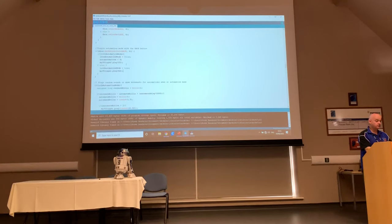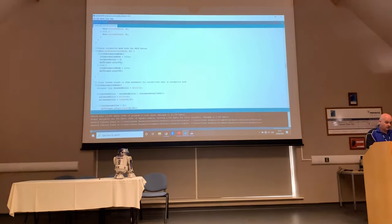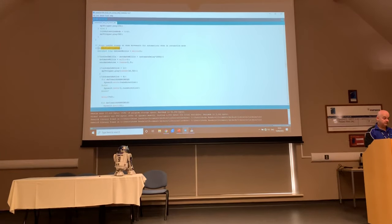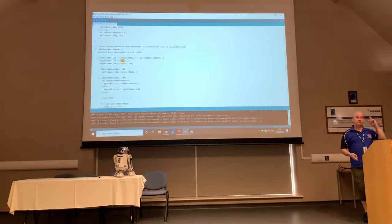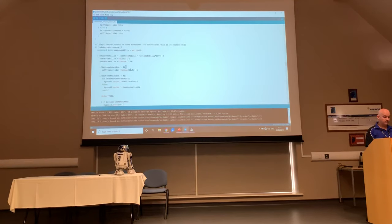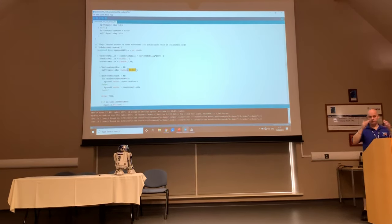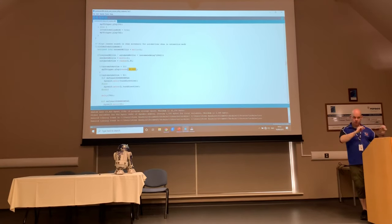Again, you get audio cues to say you've gone into that mode or out of that mode. So here we go, if we're in automation mode, start timer. So basically that's the internal clock of the Arduino. It starts and makes a point of whatever the time was when that started. And then randomly it will play a track between track 32 and 52. The numbers of these tracks is going to become very important shortly, okay?